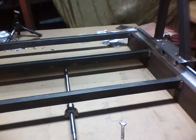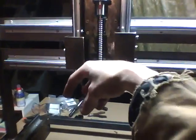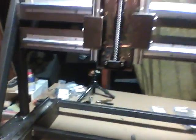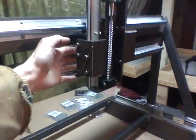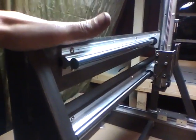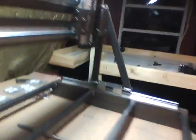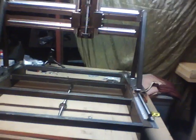I have a tremendous amount of grunt work to do now. Now that I can see it, I can start designing — like this bracket that's going to hold the router and the Dremel tool and the printer head — and I can figure all that kind of stuff out. I've got to figure out that bracket that goes below, and where I'm going to put the lead screw for the Z. I'm going to put it in the middle here, possibly on top. This top actually needs another piece of rectangular tube going on top, just to stiffen it up and make it a little prettier, which I might add the screw to. Gussets and triangles everywhere just to stiffen everything up, cleaning up welds, drilling a lot of holes. It's a lot of work.